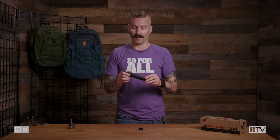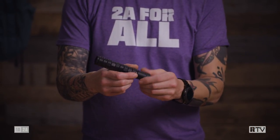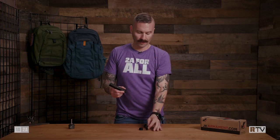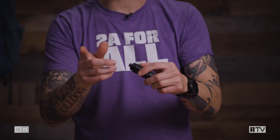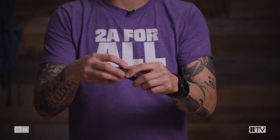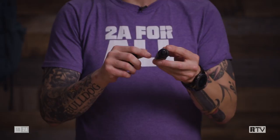Let's have a look at what you get. The JK 105 kit comes with your standard base right here — this is the part you'll serialize for your Form 1 — and there are nine modular baffles. They call them cups or dividers because they have to play the solvent trap game; we don't. It can be as small as just over two inches, and at full length it is five and three-quarter inches. The 105 means that the diameter is 1.05 inches.